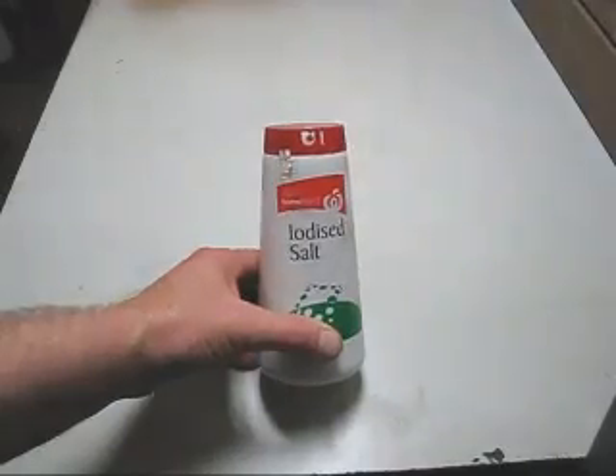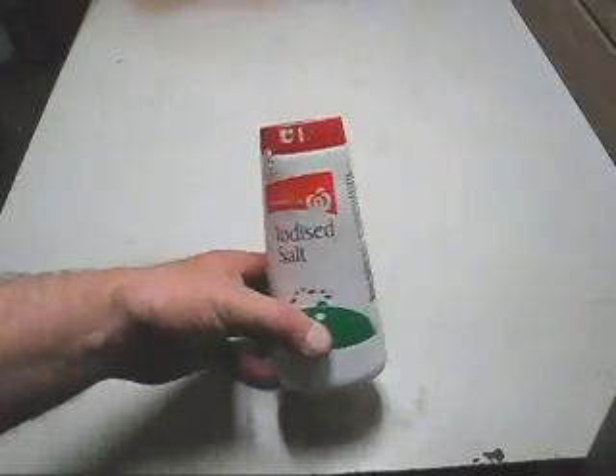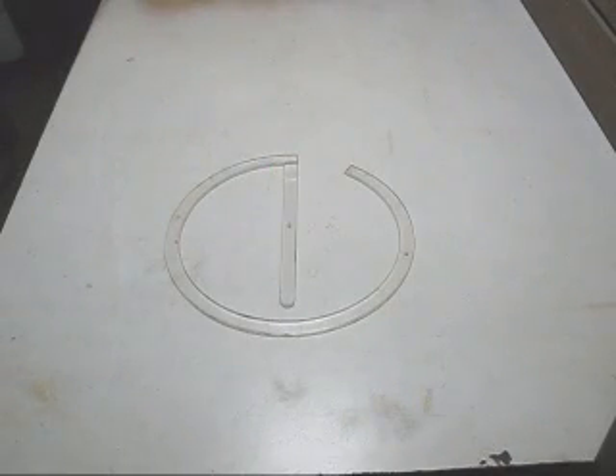Here is the first method I'm going to try from Myford Boy — he's using salt as a flux. This is the table salt that I've got at home. Myford Boy says if you use salt as a flux for the molten aluminium, it does make the molten aluminium more fluid.